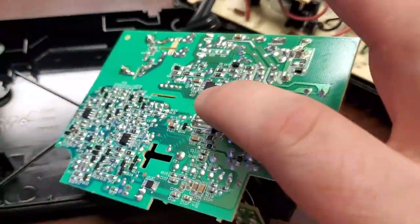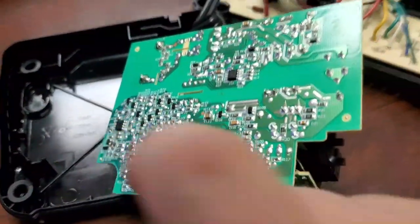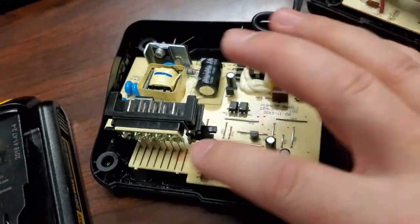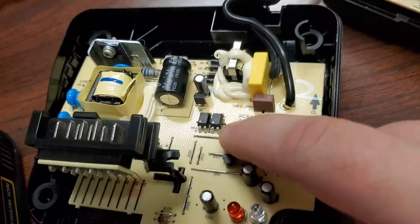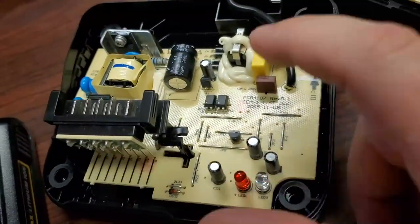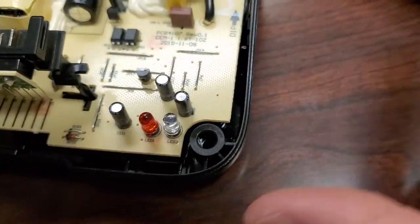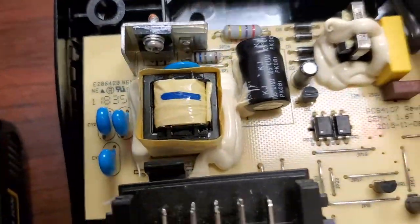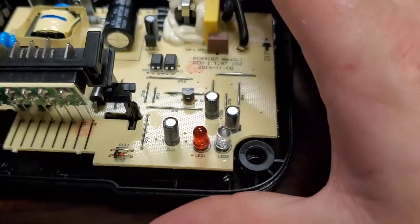On the bottom of the DeWalt board there are several separate ICs — there is no single master brain box controlling this charger. Several small ICs take simple conditions and alter the charging accordingly on the pins. There is a feedback loop using opto-isolators which ramp charging up or down. There are also a bunch of unlabeled jumpers, which don't help when you need to troubleshoot. If anything were to go bad it'd be easy to fix, but nothing is labeled too well.